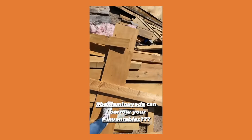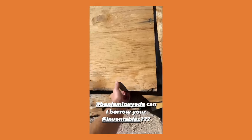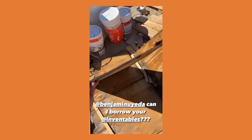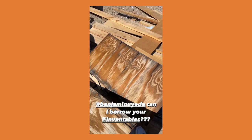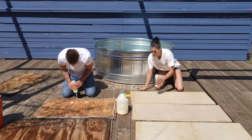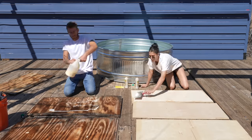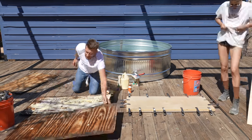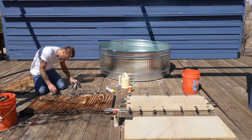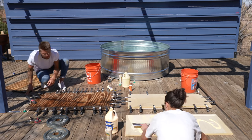I kept all of the wood that I tore off the shed — these are where the polycarbonate windows are now. They're super rustic half-inch or quarter-inch plywood and I think I'm going to try and CNC a sign. My friend Rachel Metz was also borrowing Ben Ueda's CNC the same day, so we both did our panel glue-ups. I used spring clamps and a lot of glue considering how rustic this wood was, and it worked out great. I threw a couple of 25-pound weights in the center of the board to help hold it down as well.